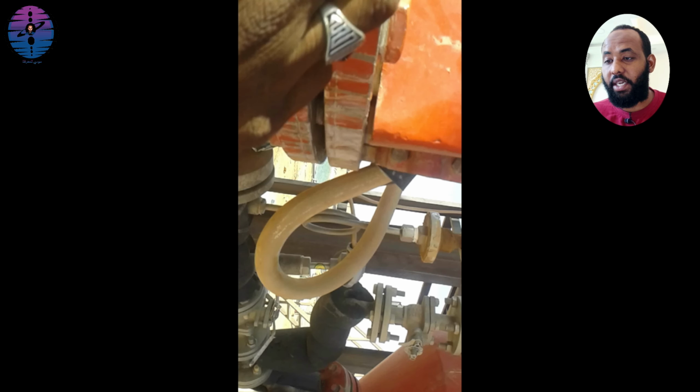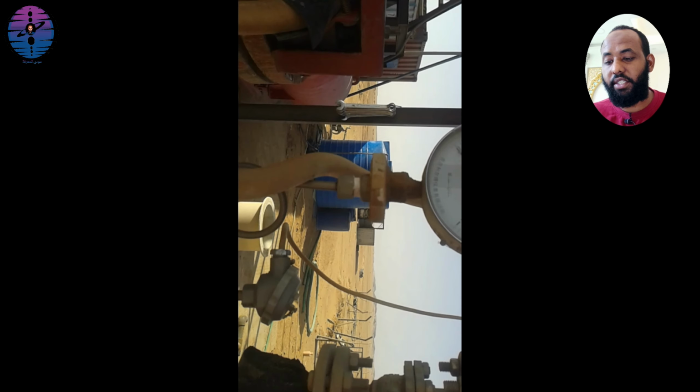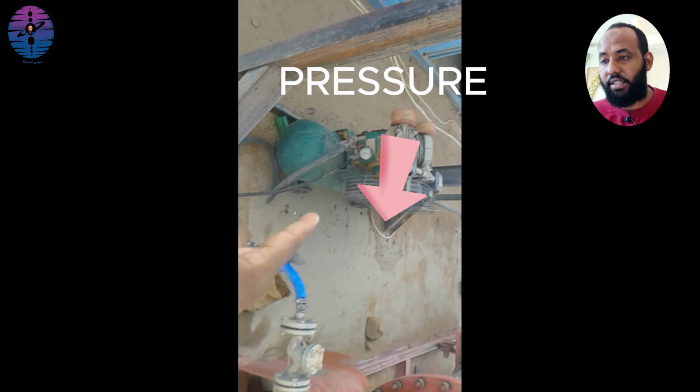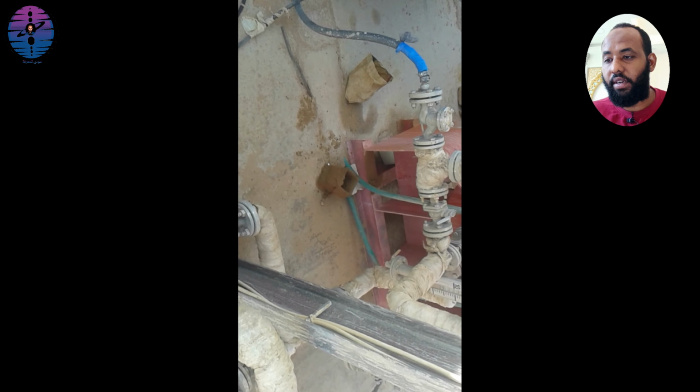A bypass valve collects periodic samples to check the remaining gold concentration. Before entering the heater, a digital meter records the amount of solution entering. Once the heater fills, it activates, heating the solution to 100 degrees as read on the control panel.